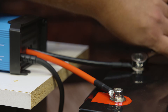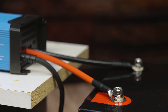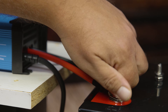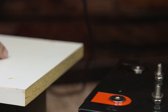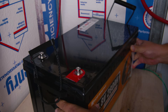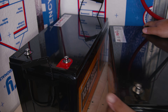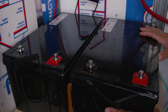In our case, the batteries are only a few months apart — three months at most — with light use. This is why the next step is crucial: if you're using two batteries, charge them each to 100% first. We're using the Victron Smart Charger 30 amps for 12V lithium batteries — the same one used in our lead acid to lithium video. Once fully charged, you can optionally let them rest until they reach their resting voltage, which for 12V lithium batteries is 13.6V.